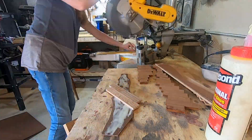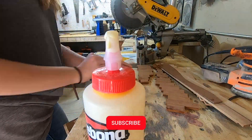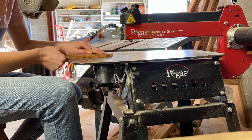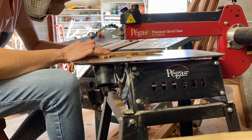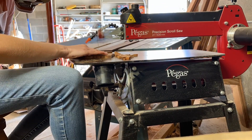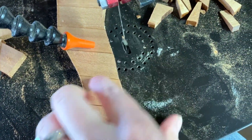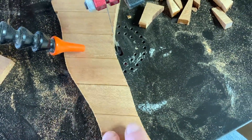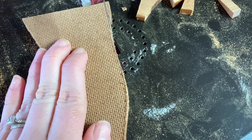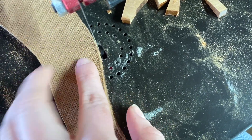And some more depth as we go — hopefully they look a little bit like the Smoky Mountains. I got a layer done here, obviously a lot of scraps. When you're scrolling, it is easier for the blade to cut through one layer versus two. So if you get in the groove and you're cutting the other way, your blade will feel some resistance. Sometimes the blade naturally wants to go against this backer, but it is easy to accidentally overstep, so try to be careful of that.